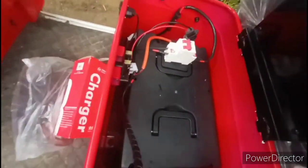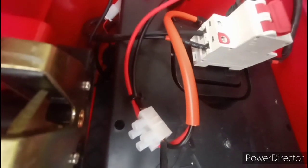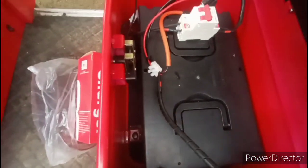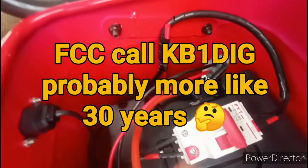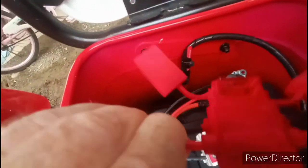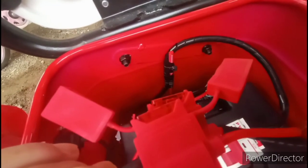You can leave it like this with this wire coming off of here going to your solar panel. It's protected by a 20-amp fuse from the battery — so maybe that's enough for you. Me, I'm old school — old ham radio for about 40 years. I like the idea of two 10-amp fuses in line going up to the MPPT controller.